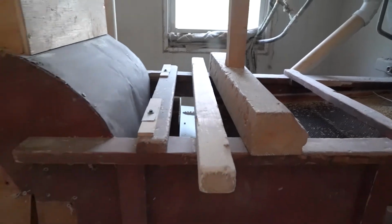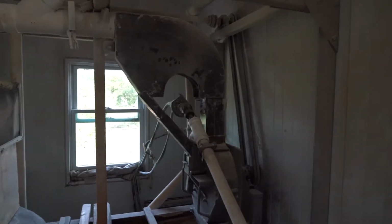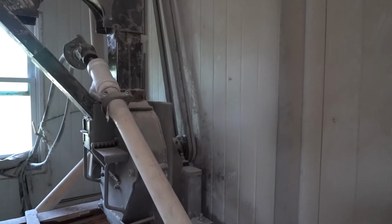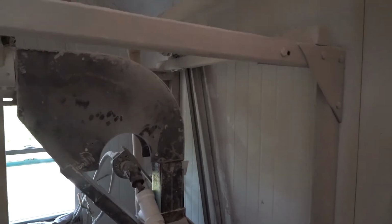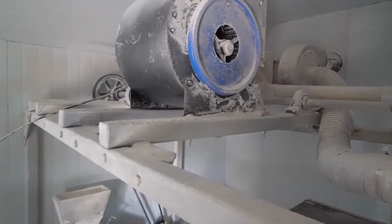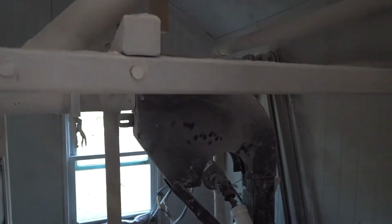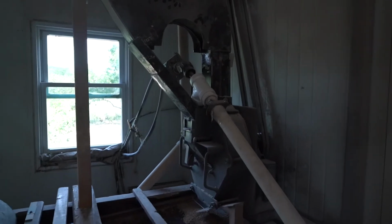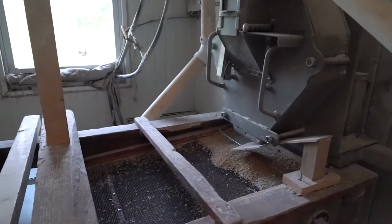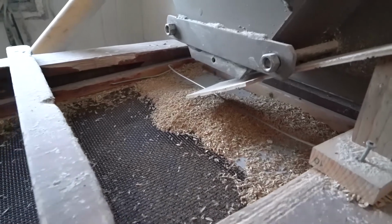And how is this powered? It's powered, there's a line shaft coming in from a diesel that's outside, and then belts down to the mill. But you sold a number of these that are being powered with a 10 horsepower motor, correct? Yes, yeah. You can also put a 10 horse motor on these dehulling machines here. And I've seen one of them at least, it's equipped with a digital readout. For speed? For speed, yeah, with the VFD. I think Stuart has one with that. So you can power this however you want. But the mechanism is the same.